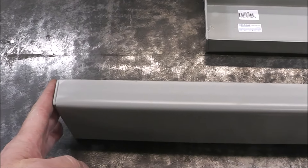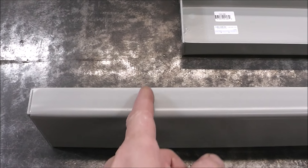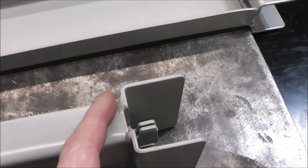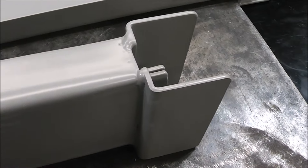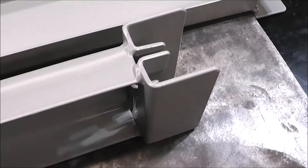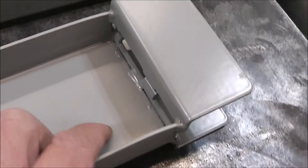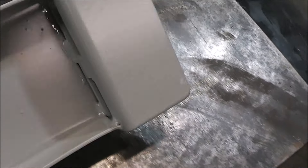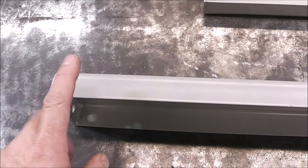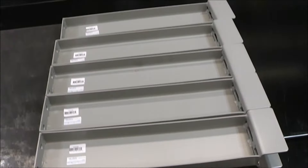I'm going to make these three and a half inches. The first thing we'll do is come back three and a half inches from here, make a mark, cut this off, and save the piece. Then we'll come over here and cut — you can see it's continuously welded here with a couple of spots on the inside as well. We'll clean this piece off from that piece and then weld our saved piece back onto it. We'll do all the plasma cutting on all six of these.